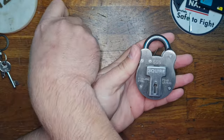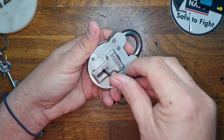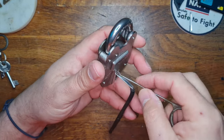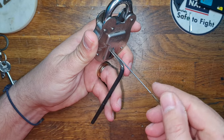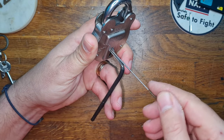To get this open today I'm going to be using the UK Lock Picker set. They've got their version of the half bent nail, and we're going to apply tension with this. As soon as we've got the tension on, the lever pack will start to bind. We're looking for the binding levers — apply tension and then just go along the lever pack feeling for whichever one's stiff.